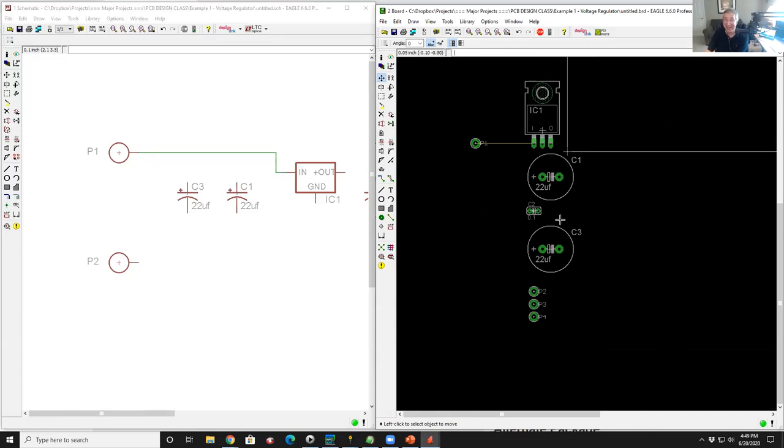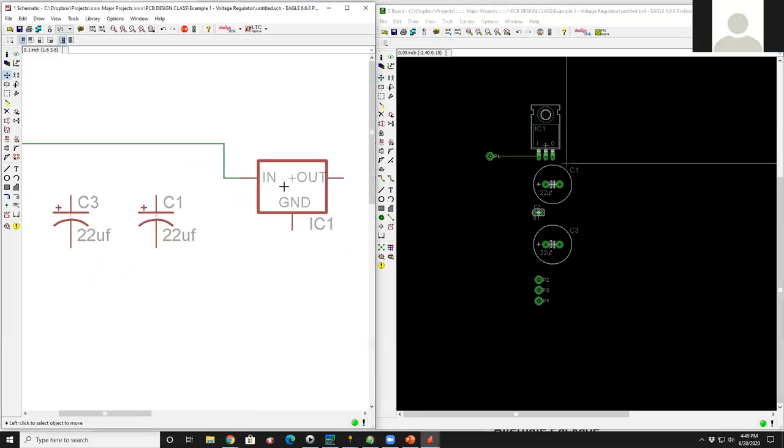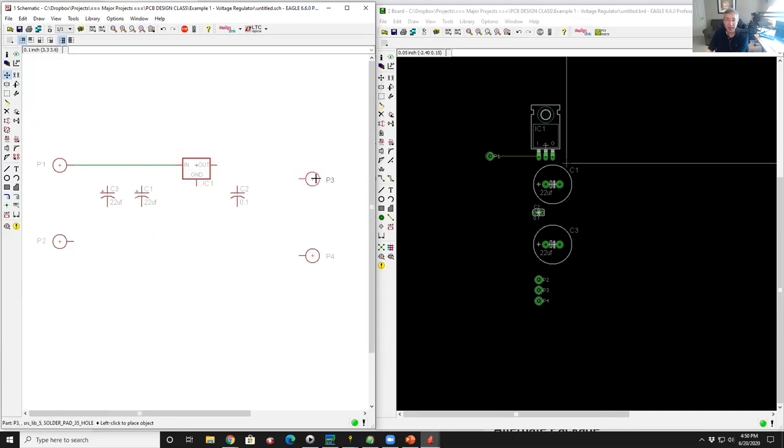So yes. So let's finish off the schematic, then I want to show you how clever these nets are. To make this a little more drafting appealing, I'm going to go into the selector mode. I'm going to move this guy up and drop it. And then I want to move this vertex here. So I go to that point, I left click it, I drag it up, and I click it again, and I drop it. So it cleans up the schematic.